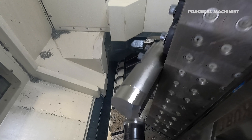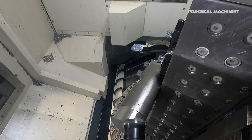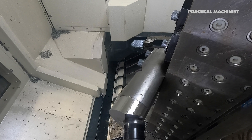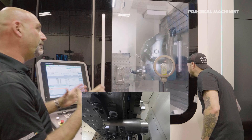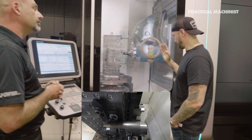We're running this dry, and it's not just for the cameras — we're running dry because it's steel. If you introduce coolant during the cut, the cutting edges experience a hot-cold-hot-cold temperature fluctuation that leads to thermal cracks. We build our geometries and grades to help prevent that. Next, we're going full slotting — feeding in from both sides, about 80 thousandths depth of cut. Now we're doing full engagement of that two-inch diameter. With the piece hanging that far out, if we can't secure it further, we look at geometries — ones with a land on the end for stability, or a sharper edge as needed.